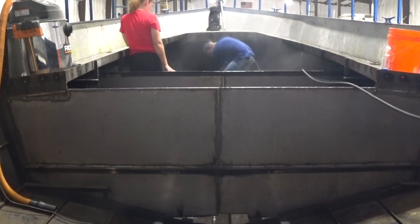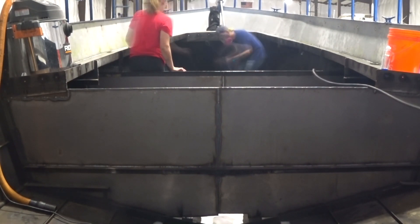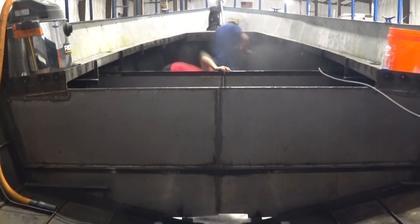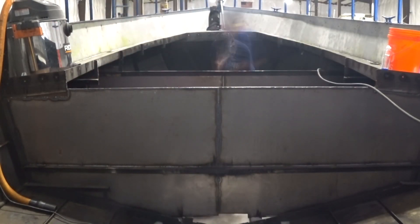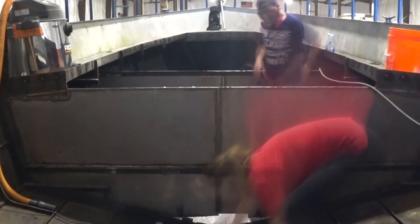In our small project here, the entire hull of our boat is made from mild steel, which is iron melted down with a small amount of carbon added to it. Mild steel, also called low-carbon steel, is only about 0.05 to about 0.3% carbon, but that's all it takes to turn it from being just iron into being basic steel.